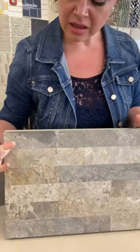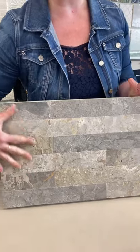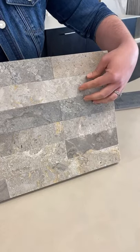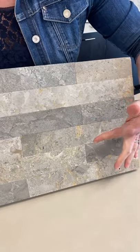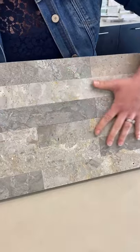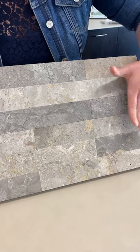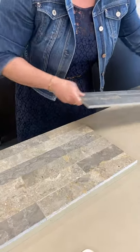Or if you prefer to go the natural route, we have natural stone here. There's an inherent beauty to natural stone — you guys know I love natural stone, made by God. No two pieces look alike. This one has a nice brushed texture to the surface. With natural stone, if you take a copper wire brush and scour the surface, you'll see the softer bits. Where the veins are, those are softer pieces of the stone, so they come out more when they brush the surface. You get this really nice undulated surface to the stone. I'm very tactile, so I tend to very much enjoy this. If it's sealed and installed correctly, this should last a lifetime, but if you don't want to worry about it, we can do the porcelain options.